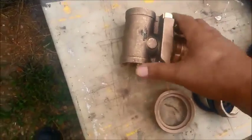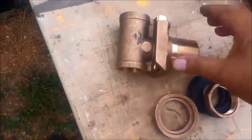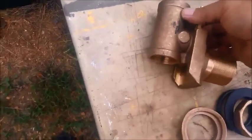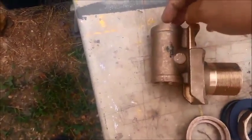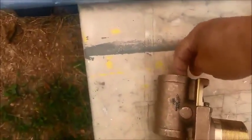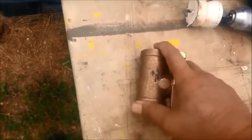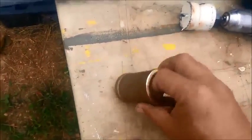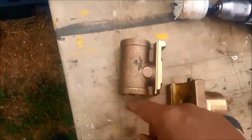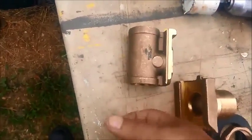As the pitless transitions through the well casing and connects to your above-ground piping, you pull your well pipe by screwing the handle down from the top of your well casing to the pitless adapter, then pulling it off that outlet. The deadhead here doesn't do anything except allow you to pull pipe - all of your pipe going down to your pump - and that pulls the load up above the casing until you get it clamped.